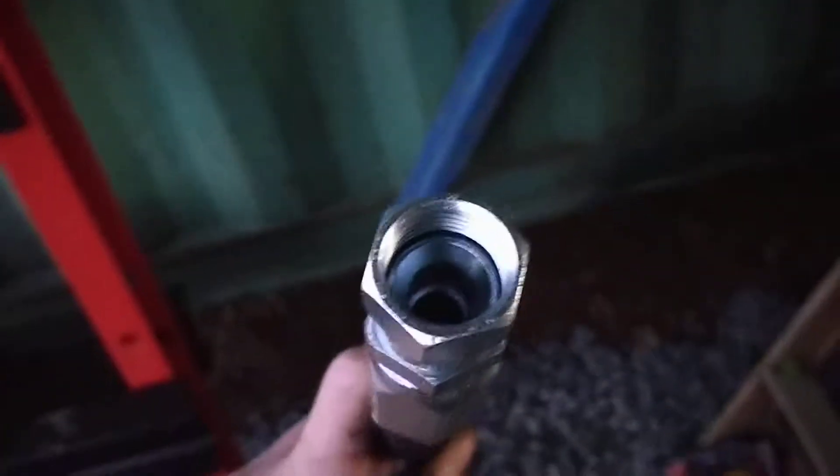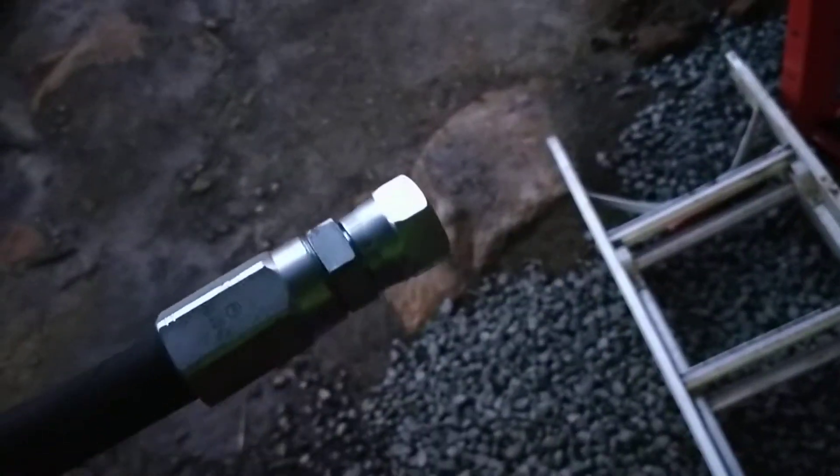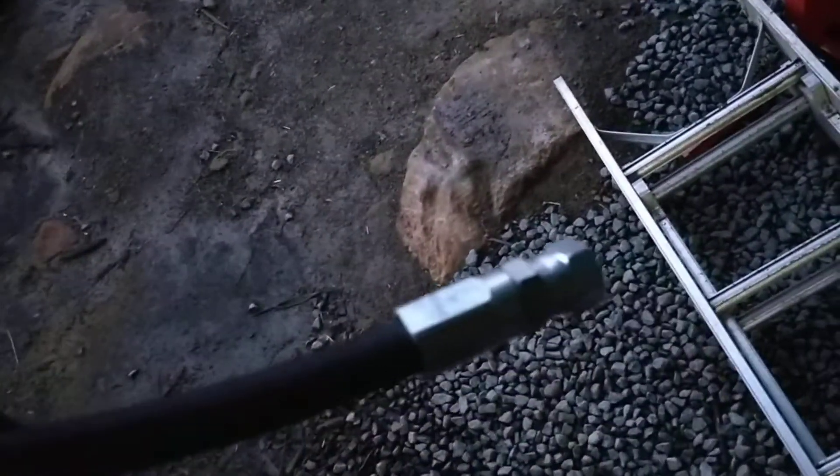So there you go — there's the finished hose. Two JIC females on either end, ready to replace the old one. Sorry, I'm running out of light here. So remember — the ferrule's a left-hand thread; back them off half a turn before you go; and then add some lubricant when you put the fitting into the ferrule. And the last tip: shop around — big difference in prices depending on where you go. I hope that is helpful — thanks for watching.